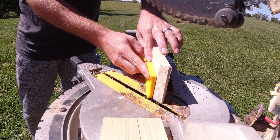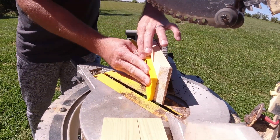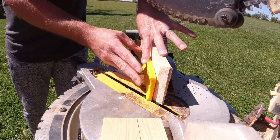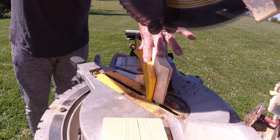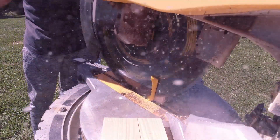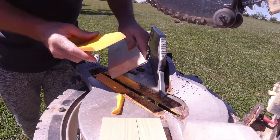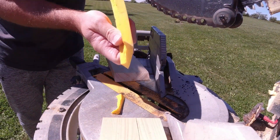What that does is the backing helps prevent the liner from getting sucked in by the blade. Once you have everything lined up, go ahead and just cut like normal. And as you can see, the form liner stays in place, doesn't get sucked back. The result is a great looking, accurate cut on your form liner.